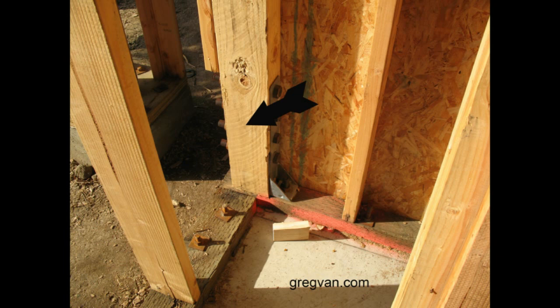You can make some sense out of this. If you're going to drill a 1-inch hole through a 4x4 post, this isn't going to leave you a lot of meat on either end of the post, and that's drilling it right through the center. If you don't drill that right through the center, you're creating an even bigger problem. On a 6x6 you're going to have even more room, and an 8x8, obviously, even more.